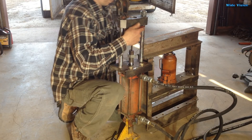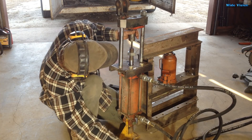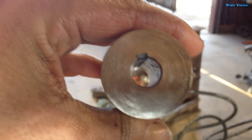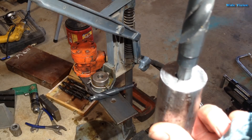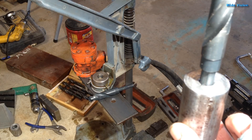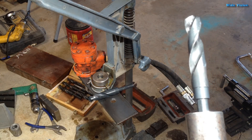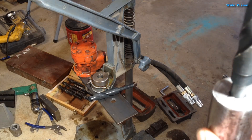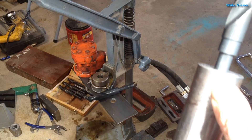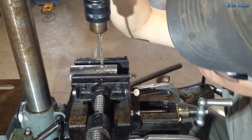Putting in this keyway — broaching it upside down like that — is really nice; it really allows me to see what's going on. The downside is I don't like having my hand holding the work, makes me a little nervous, but visibility is great. Keyway's in there, drill bits in there. I grabbed a couple different drill bits and discovered that the shanks are not all the exact same size, so some fit really tight and some are a little loose — that means I'll have some runout. But this is obviously not a precision hole rig; I just need to blast a hole in something. Now I'm gonna put in two allen screws on this side so I can squish that key into place.